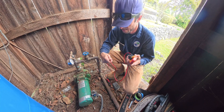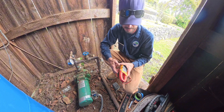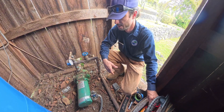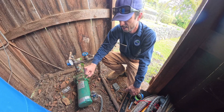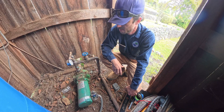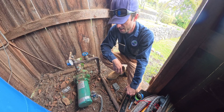Other than just calling it quits and saying you need a new impeller and a rebuild kit — which I've done in the past — the other thing I've done is we can take the cap off the end here and try to spin the shaft, see if we can break it loose. See how bad it is, we'll give that a try.